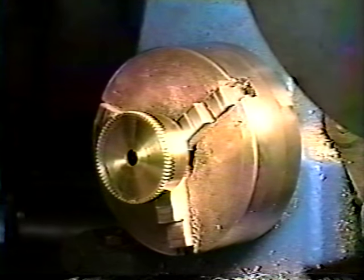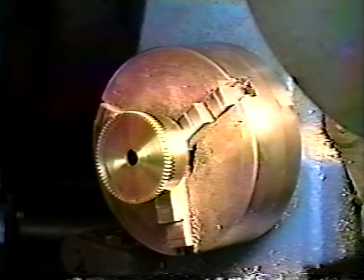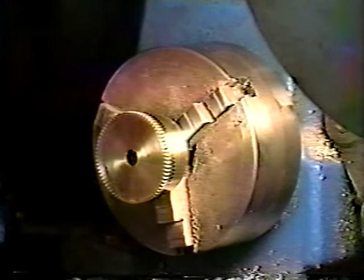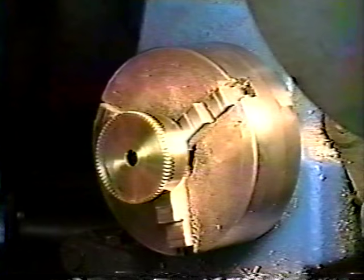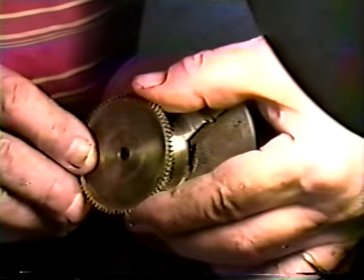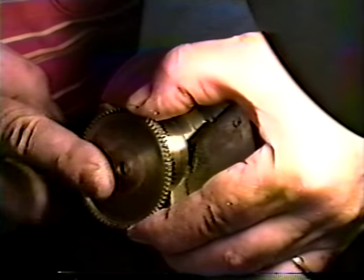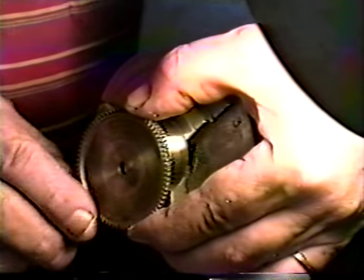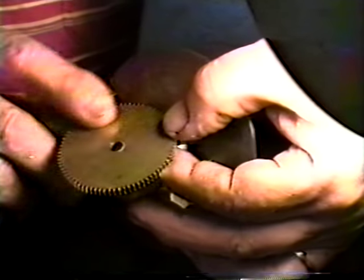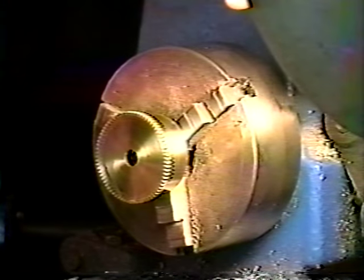Now in some cases, you get what they call a two-piece barrel, where the barrel drum is already soldered to the plate, and you don't have to make a ring gear, you can just make a whole plate. I've had occasions to do those, and what I do there is take another piece of solid bar stock, countersink the inside part, put the barrel on it, and then sweat it on. So then you wind up with another nice big good barrel. You've got all new teeth in it. Teeth are all nice and straight. They're not worn out. Makes for a good job.